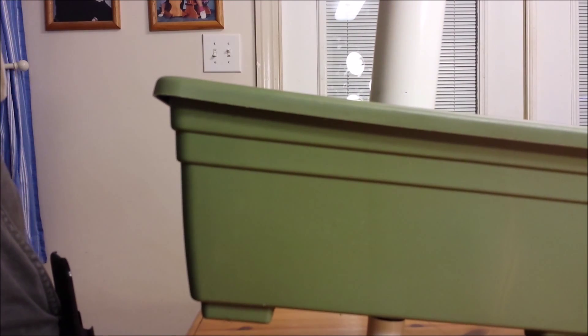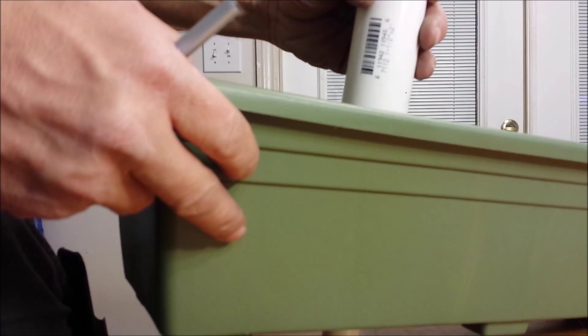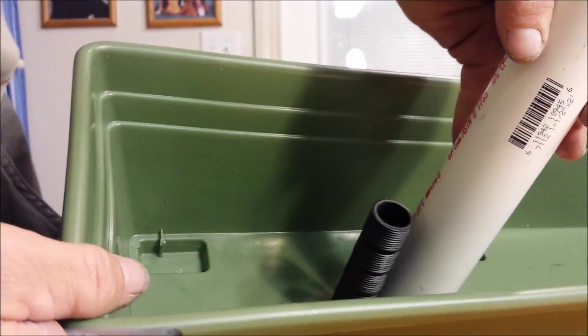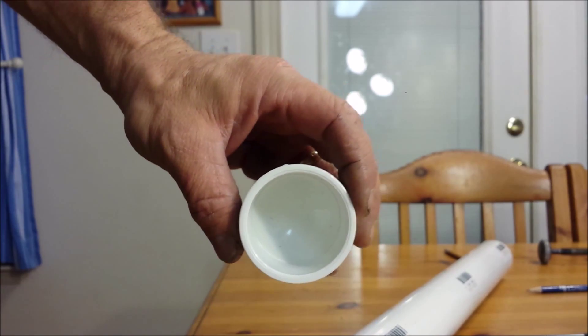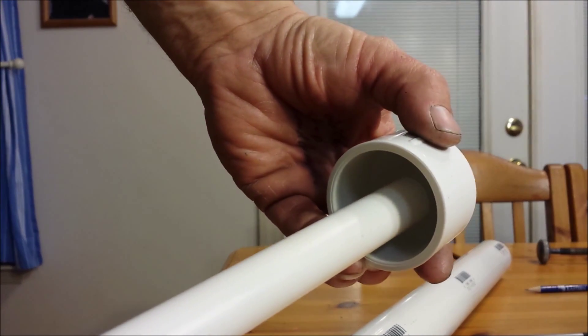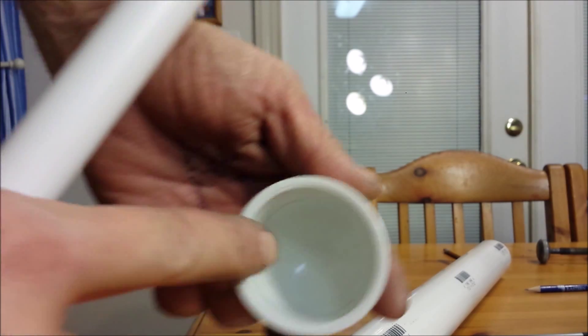This is the part that's going to create the suction — it needs to be airproof. This is what creates the airproof seal to create the suction. This needs to be a little bit taller, but not much taller, than the riser pipe here. So I'm going to put it right beside the pipe and mark the top of it. Over here we have a cap that will go on top of it. The riser pipe goes right to a little lip in there, and there will still be plenty of room at the top because it's rounded for the water to flow.